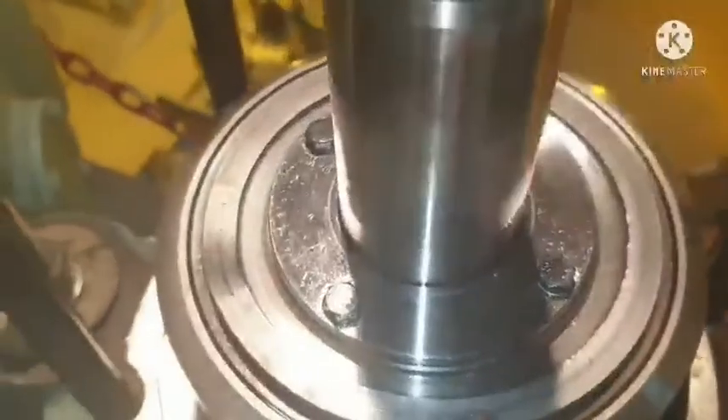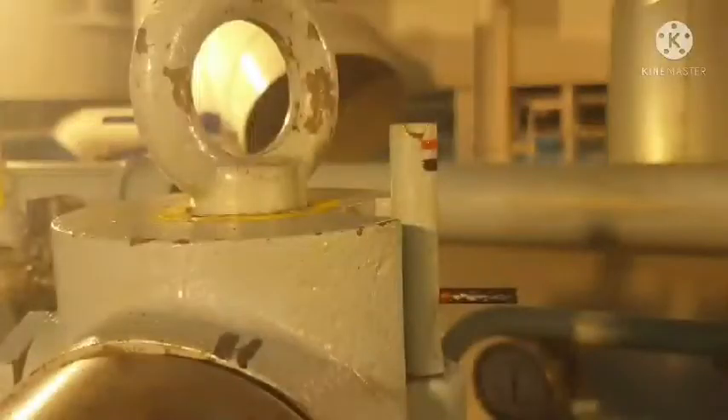As you can see, on the top of the piston there is a protruding part that is about 5 mm difference. The one I am pointing to now is the protruding part — the difference between them is about 5 mm. That difference is the same as what we observed during the rotation indicator check between the black and red marks. The black mark indicates that the contact point of the rotation indicator tip is at the lower part of the cylinder top, while the red mark indicates that the tip is touching on the protruding part of the spring air cylinder piston top.